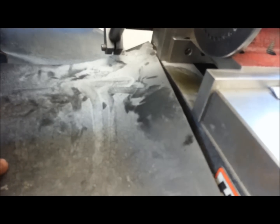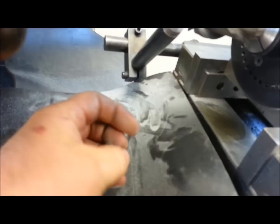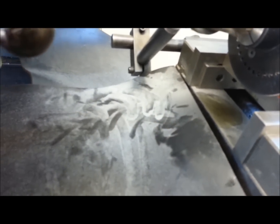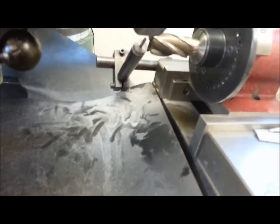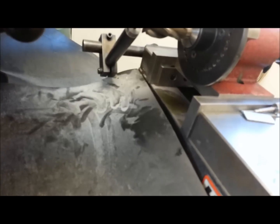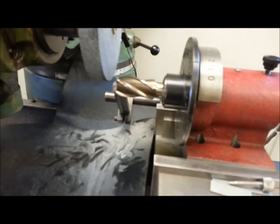You can see all the dust and everything that I've been creating here — cover up your machine. I've got rubber mats all over this thing right now just protecting the machine. That aluminum oxide is just nasty — you don't want to get it in your ways, don't want to get it anywhere in your machine. Don't use any air — cover it up carefully, pull up your mats, take them outside, wash them off. Use a shop vac to suck it all up. Keep the aluminum oxide dust out of your mill or you'll really tear it up.